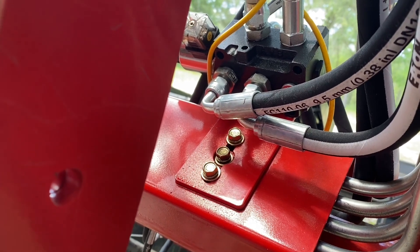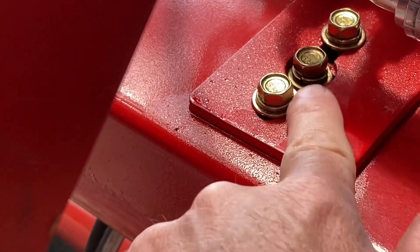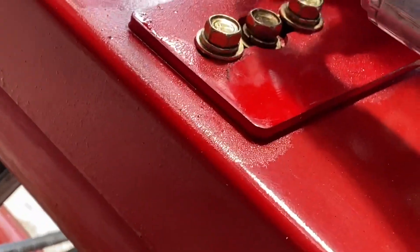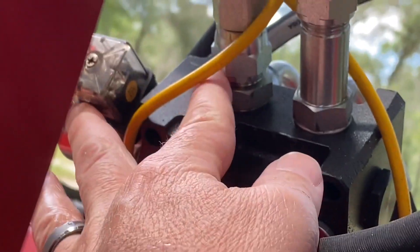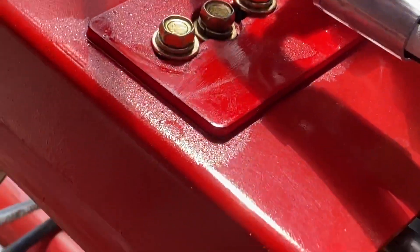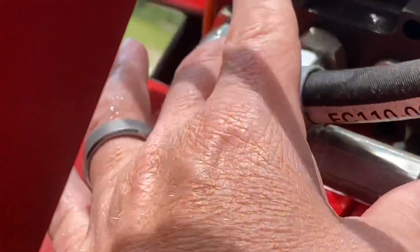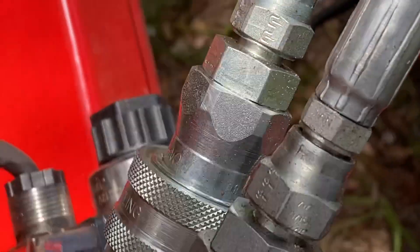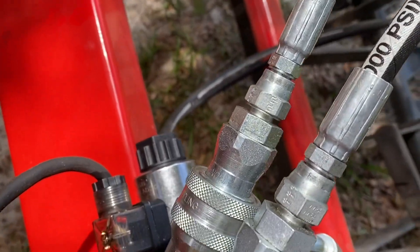So let me show you what couplers I got and the little leaking that's still occurring. This is the area where the leak is coming from — you can see it's still leaking a little bit, but it's not even half as bad as it was. I can't see anything that's really fresh on these. I've checked and tightened all these fittings up. These are the two fittings that I replaced this morning, and that was where the big leak was coming from.